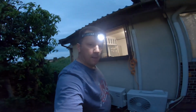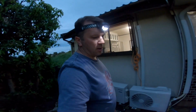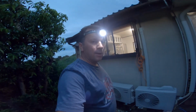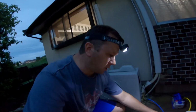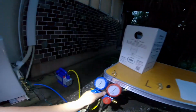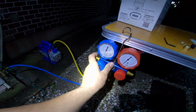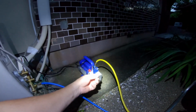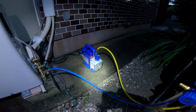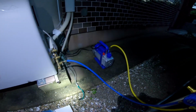Okay, elapsed time, just double check here. Yeah, elapsed time of 9 minutes. So it'll be 10 minutes by the time we get to it here. What I'm going to do now is turn off the vacuum. Nothing changed on the gauge. The gauge stayed at -30 down there. It didn't move from where it started. I saw no moisture coming out of there, although there's a little bit of moisture on there. I think it might be partly oil. Of course, I'm doing this at night just about because that's when I do these things, I suppose.